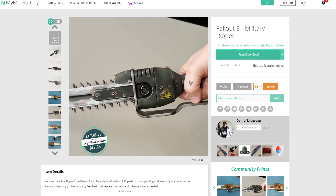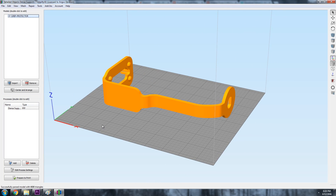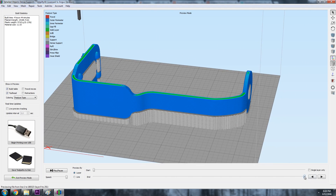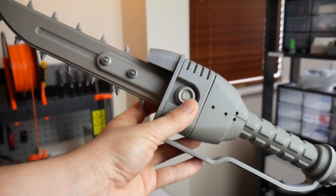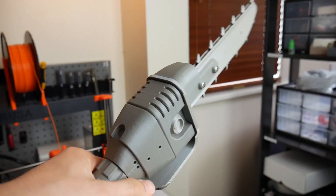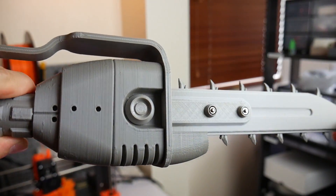To complete my test, I wanted to print something huge with loads of parts, so I settled on this awesome design for the Ripper weapon from Fallout 3 by Daniel Lilligreen on MyMiniFactory. It's got loads of parts, some of which needed serious supports, so I developed a custom profile in Simplify3D based heavily off one sent to me by Spanner Hands. The supports were super dense and strong, crossing over each other at 90 degrees, and it worked amazingly well. The print overall was at 200 microns and 30 to 60 millimeters per second depending on the part, and I'm super stoked with the result. All the parts are dimensionally accurate and fit together perfectly — no glue, just press fits — which shows great accuracy off the printer.